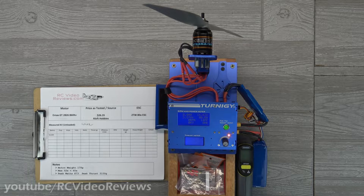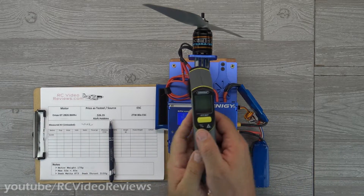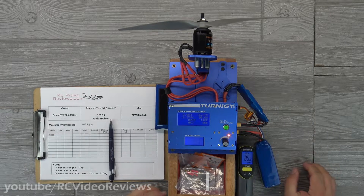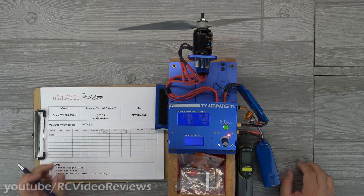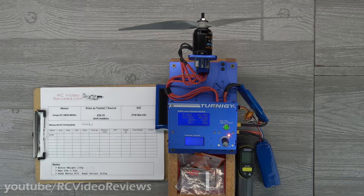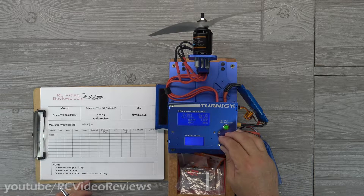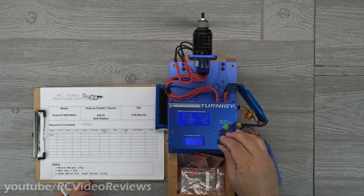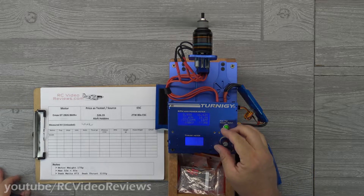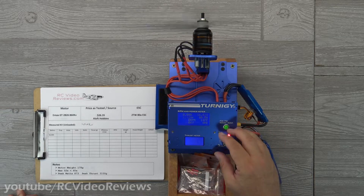Before we go I want to get a temperature reading on the motor real quick — I'm seeing about 86 degrees, which is about right because it's hot out. I'm going to spin it up and listen for vibrations; if I don't hear any I'm going to go ahead and gun it. I'll be looking for thrust and RPM and we'll get the rest of the data after I spin the prop down. Okay here we go — let's listen for vibrations and then spin it up and look for the numbers. Oh, that feels so good — perfectly balanced. I don't hear anything, so I'm going to go ahead and gun it.